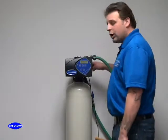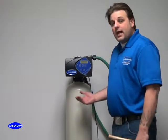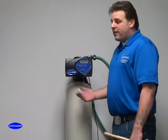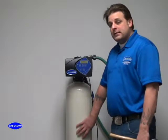Once you've got that good clean water out the drain line, you can go ahead and start opening your valve a little faster and a little faster. Now this may take some time. You may be here for a half hour, 45 minutes, an hour, depending on the size of the tank and the media that's inside the tank.